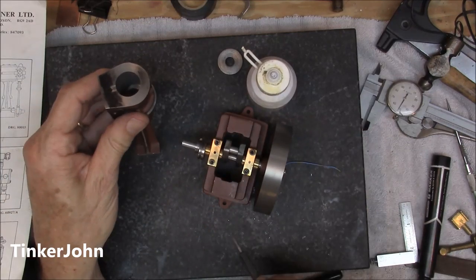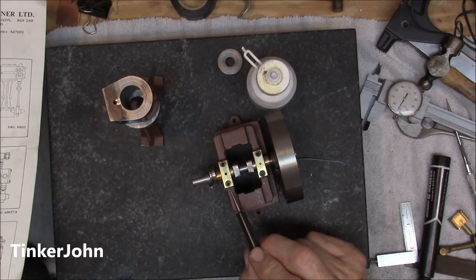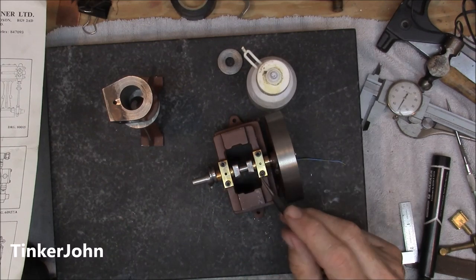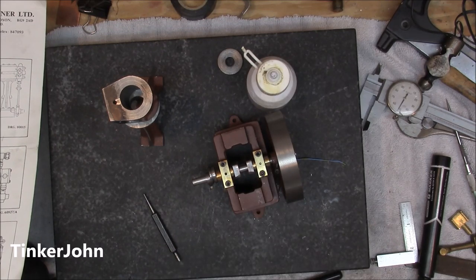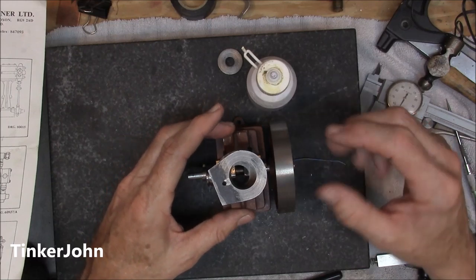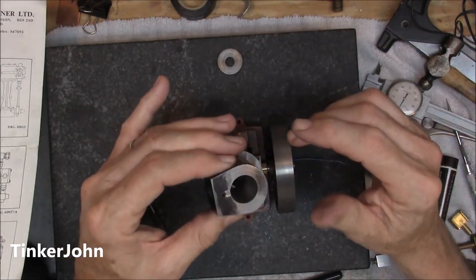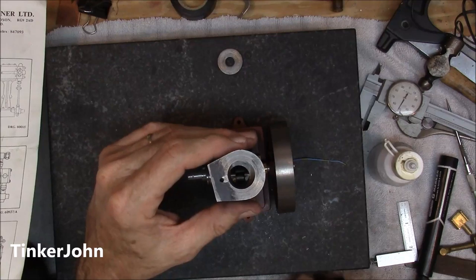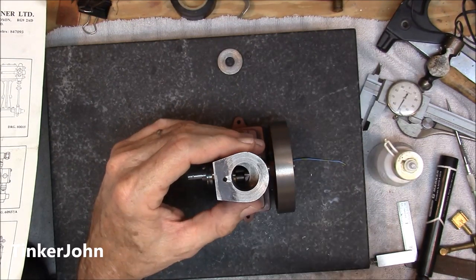There was a comment about me not showing the drilling of these holes here. In retrospect, perhaps I did not do that. All I did was just drill the holes here for the size of the tap, then did a transfer punch to the bottom of those, and enlarged the brass bushing for the set screws. The socket head set screws are only for assembly — when I'm through I'll actually be using machine bolts. In fact, I may have to make machine bolts, as these are British threads and I don't have any British thread taps; I just use American taps all the way through. Now, on to the cylinder cap — I'll use the cylinder head to transfer the holes from it over to the cylinder itself.